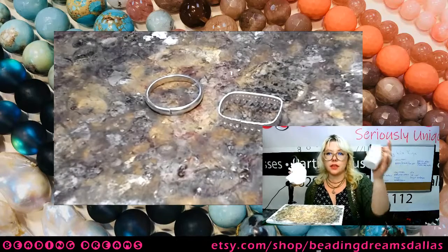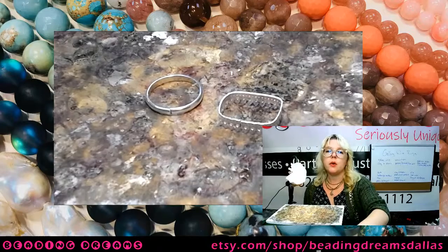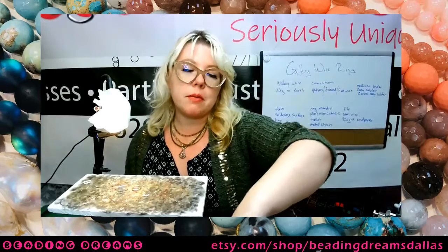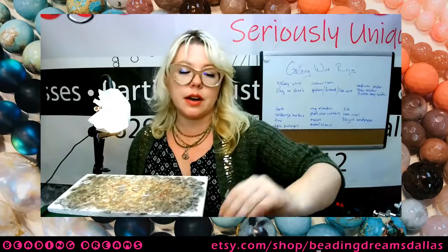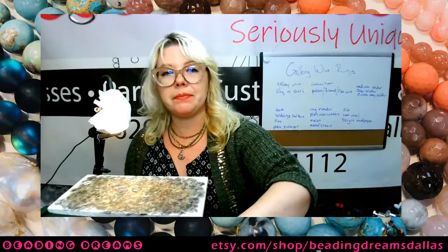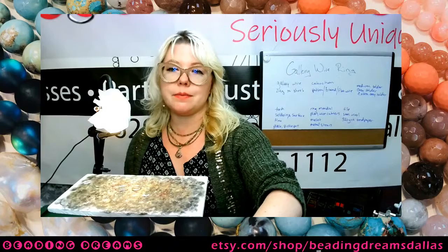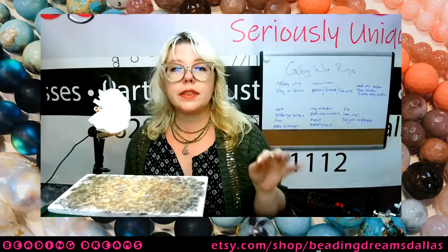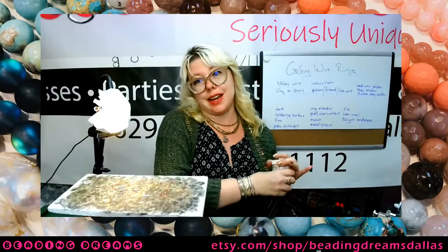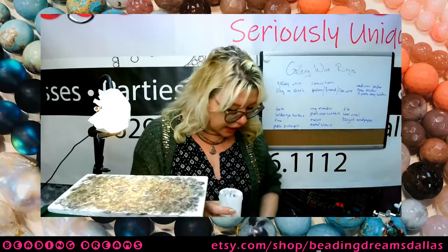And let's start with this chemical in this jar, flux, with the skull and crossbones on it. What flux is, is a chemical that protects your metal from oxidation, okay? Oxidation being a function of the heat. The first thing that's going to happen if you hit a metal that is either base metal or has base metal components with a torch is it's going to turn black. It's going to oxidize. That's a problem because solder will not flow on oxidized metal.